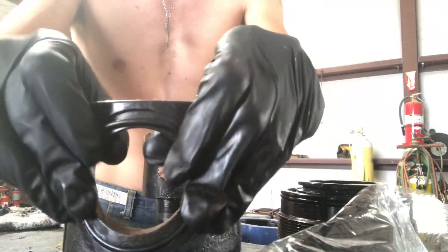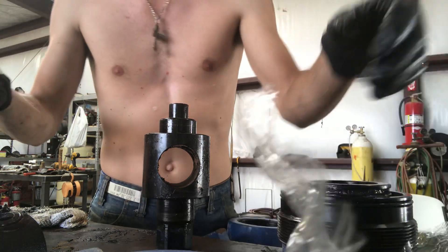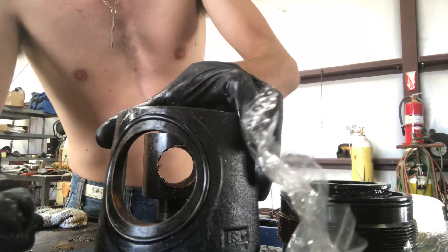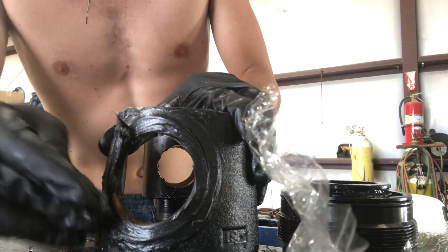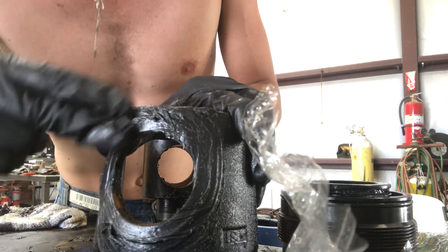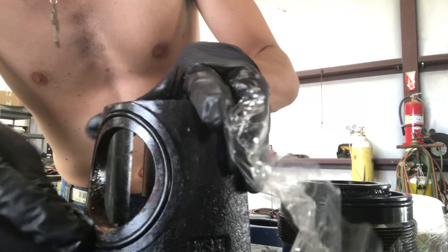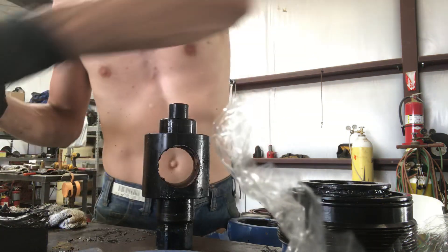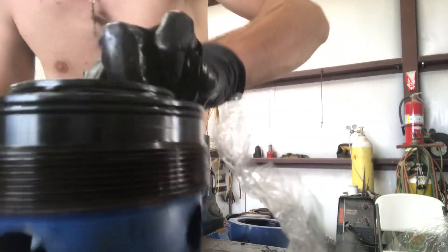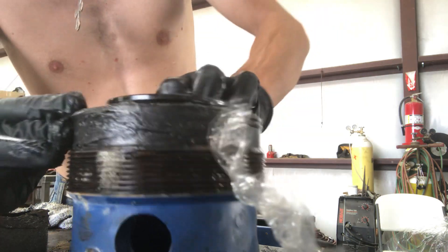Go ahead and take a little bit of your grease — you want to cover that ring, fill any air pockets in it, work it up real good. It also keeps it from falling out while you're waiting to put this stuff together. Once those are done, take your retainer and do the same thing — cover that o-ring with grease.